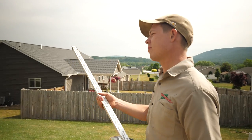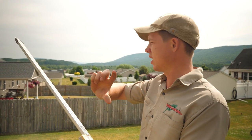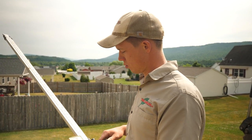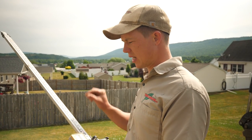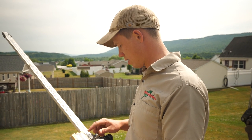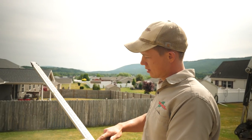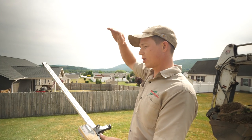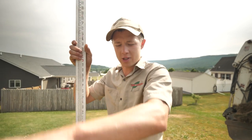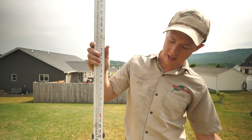I need to go down even farther because I need room for six inches of base. I'll compact in five inches of 2A — it's a limestone with fines in it — and that will leave me an inch to screed a nice setting bed. So that means I need to dig down another six inches. At 26 inches down I'm at the bottom of the block, plus another six inches for the base — that's how far I have to dig. If I put in six inches of stone, four courses of block, and two inches of cap, I'll be exactly at the paver height that I want. You have to work your way backwards: start at the top, drop and drop, figure in paver height, the height of the blocks and the base, and now you know how deep you need to dig.